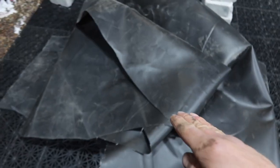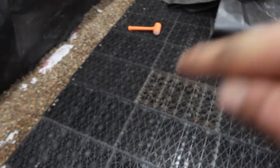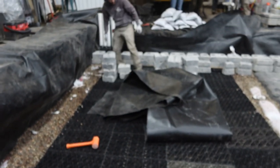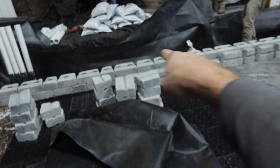Once we do that, then we'll come back with our scrap pieces of polyethylene, and we're gonna layer the entire top of this aqua block infiltration area with the polyethylene liner, and then we will cut a hole inside of that intake area, or what will look like a sunken fire pit. And what'll happen is all the water will funnel down through that intake opening and go down through the aqua blocks and go over to our pumps over here,